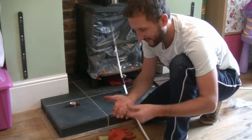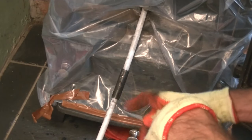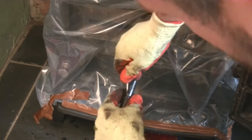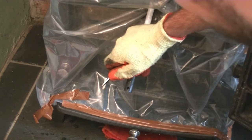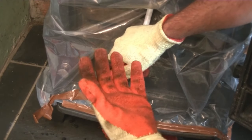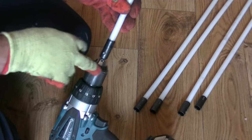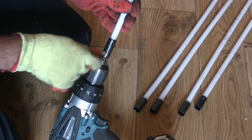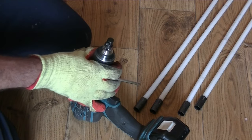This is the time to put your gloves on because the rods are dirty coming back out. When releasing the rods, because that button is attached to the rod below, you go in at that angle and push it in that direction down — and that should come apart. It's a bit fiddly, but it just means you're levering it in the direction of the rod. If you push the wrong way, you'll never get them undone. Exactly the same goes when releasing it from the drill — put the allen key in that way, apply pressure, then push backwards, and it comes straight out, no problem at all.